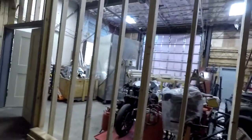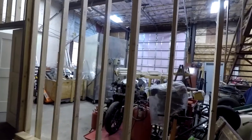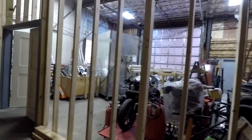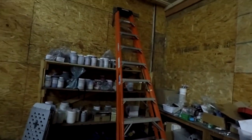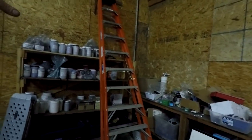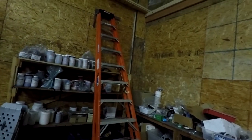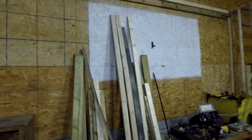And that was the other thing with the oven — sometimes she smokes. You're burning off oils on the inside of metals that you can't get to, or sometimes the powder coat smokes a little bit. If it was in this room in a confined space, it would get smoky and we'd have to put a vent in, which I wanted to do anyway. There's a window actually behind that door, but we didn't put siding on the other side, so I can't see where the window is. I'll probably have to pull all that out at some point and do an exhaust vent in there, just so we can remove any powder or dust in case it gets bad in here.